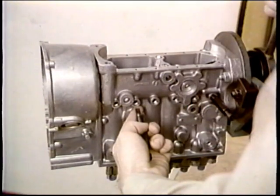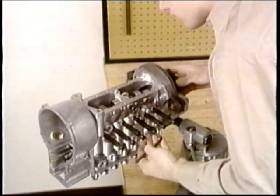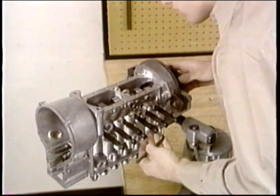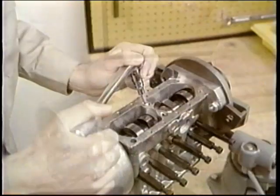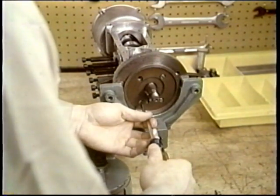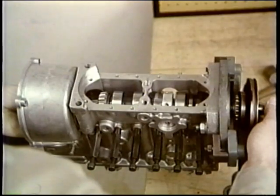Now rotate to TDC number five, the next cylinder in the firing order, and thread in this holder. With all tools in place, finish the job by turning each socket head screw just until the camshaft spins freely. A few pumps require a different tool — see your written instructions. If your pump has a center bearing, remove these retaining screws. With the drive coupling removed, take out these four screws from the bearing plate. And here comes the camshaft, including its center bearing. With a soft-faced mallet, you have tapped the other end to free the plate from the housing.